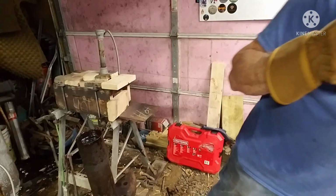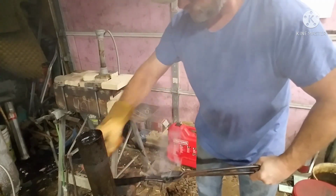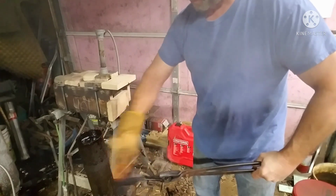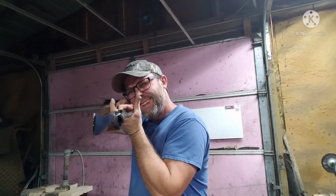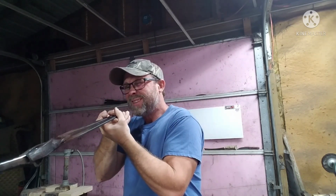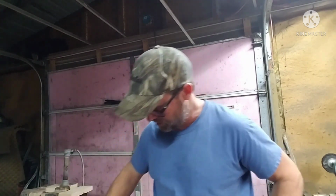That's good. Alright, guys, we've got it heat treated. No warps, which is good. Let's check to see how hard it got. That's what I want to hear. See how it grabs up here? Not down here. So we're in good shape. We'll get this thing cleaned up and we'll get back to you.